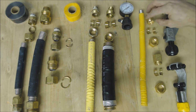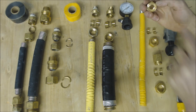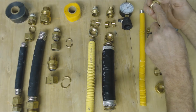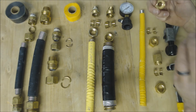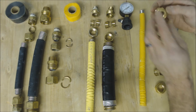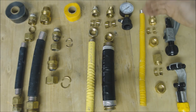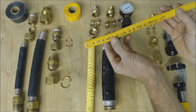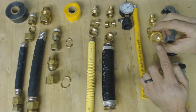You can only use the same manufacturer's fittings — so this is Wardflex, you can only use Wardflex fittings. The Wardflex fittings actually have two ways to seal: they use a double flare in the front, but there's also a gasket down inside the fitting. It's not a rubber gasket — rubber can end up breaking — it's a different type of gasket that compresses and seals. You can tell it's Wardflex because it says 'Wardflex' right on the tubing, and the nuts say Wardflex on top — very easy to identify.